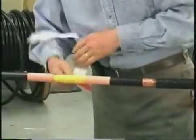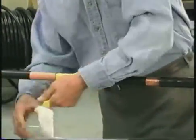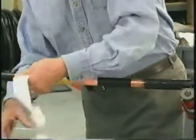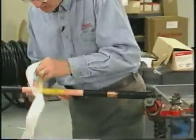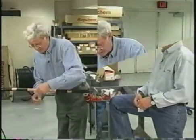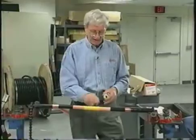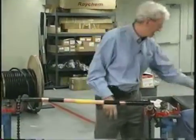So you're just filling in any voids, Dennis? This is a stress relieving material and a void filler so that there are no air voids trapped under the heat shrink tubing. But that's not semi-con, right? No, definitely not semi-con. So that's about the right diameter — just a little over the diameter of the cable insulation.